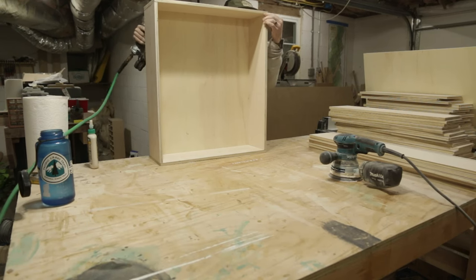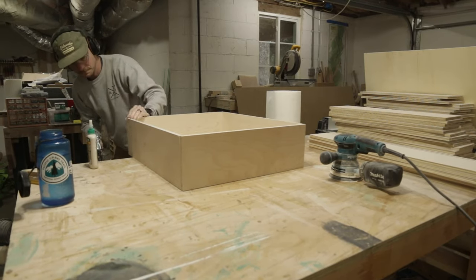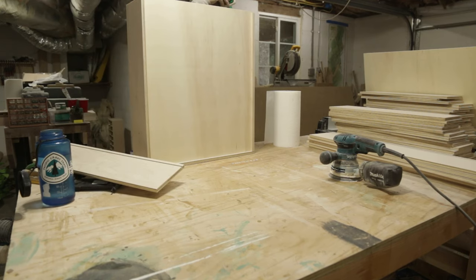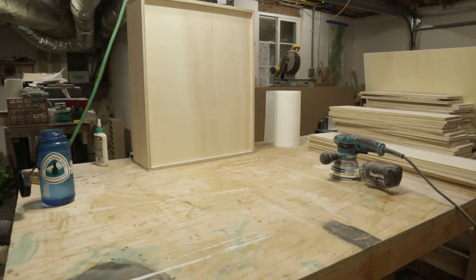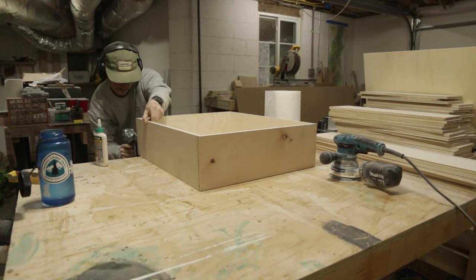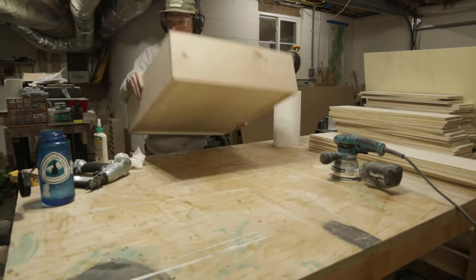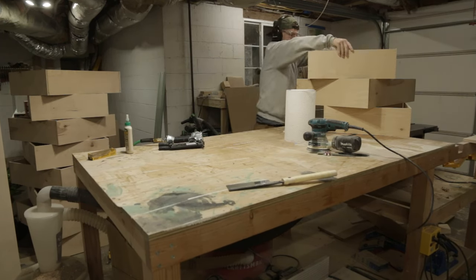Do an initial dry fit — it's a pretty easy process where you hook it up into one bottom, glue a side, nail it in, then repeat on the other side. Once you have that in, you'll have a tight fit; set it aside to dry. Also a good time to wipe it down nice and clean. After about an hour of that — boom.